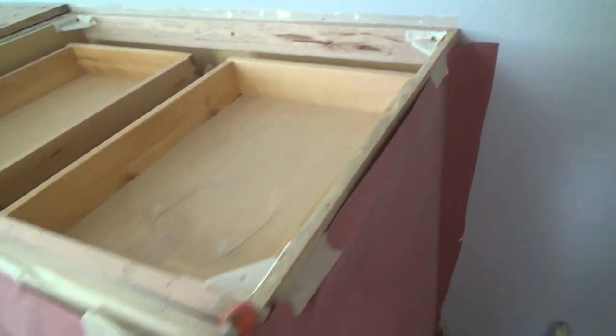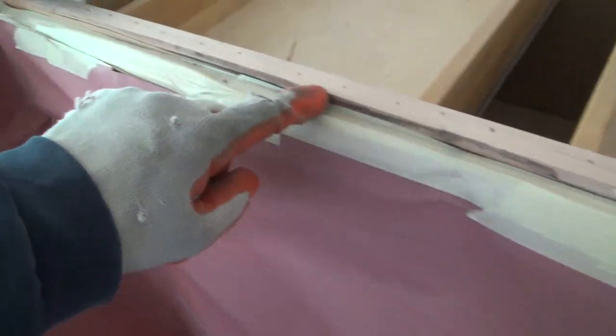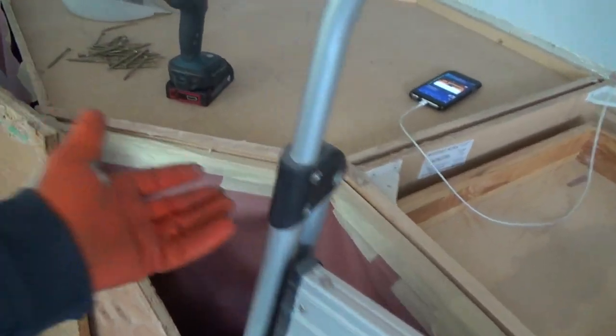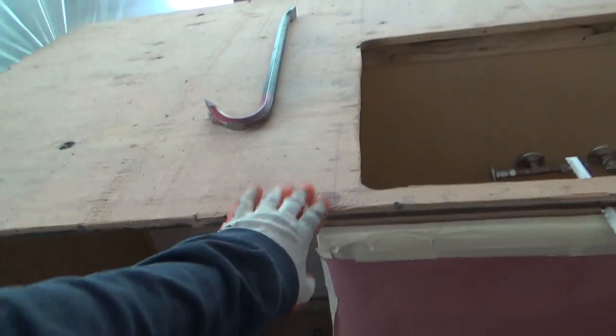I had to do the same technique, starting from that corner, working up here, going across this way, because you don't want to pry on your finished edge and get it to bead off or flake off, because that's part of your finish, see? And the same thing with this one. This one was tough. I had to do that same technique all the way along here, along there, just to get it far enough to then try to muscle this thing up and bend it up.